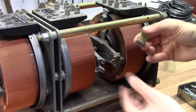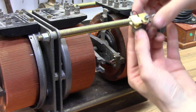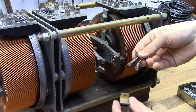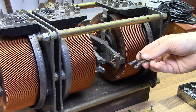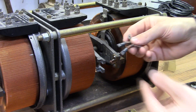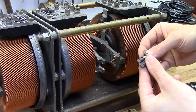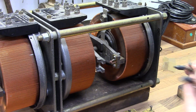So that's the brush unit there, taken out of the arm. If I pop the plate off, you get two brushes in these. They used to be called the Dura-Tracks — they made something called a Dura-Track as well. They have two brushes to stop any intermittent voltage drops — if you get a brush which skips over a gap, hopefully the other one won't lose contact as well. So they're not putting their eggs in one basket.